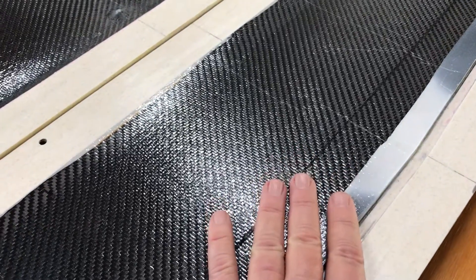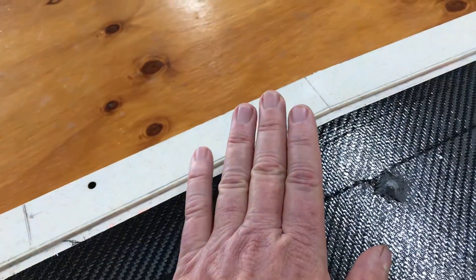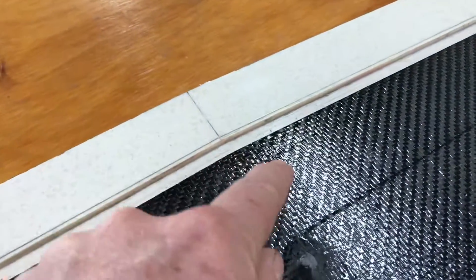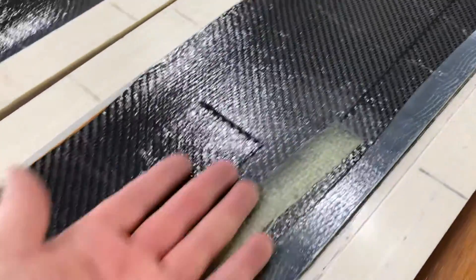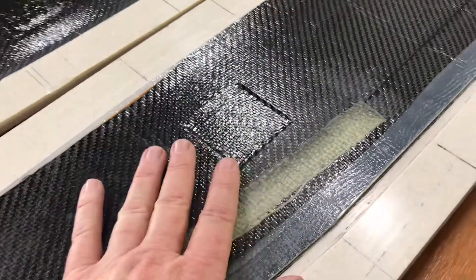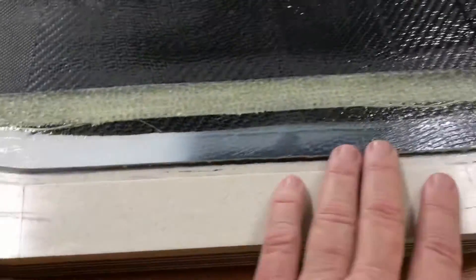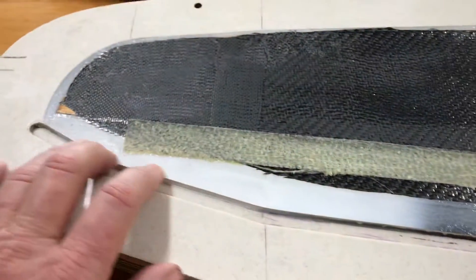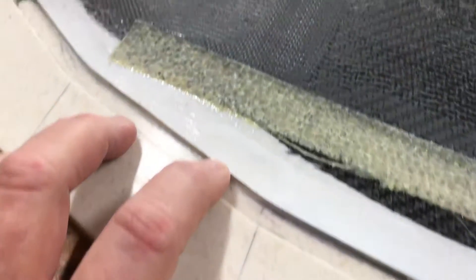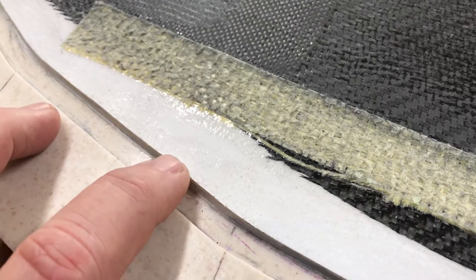That's including the veil cloth. I've left a veil cloth here — you can see the glass stops there, there's a heavier glass that stops there, and the veil cloth and carbon there. No problem — except the perforated plastic breather film, first time ever, stuck to the laminate. Consequently, trying to remove the perforated plastic from this area of veil cloth — there's no material there to keep it rigid — it actually lifted the skin off the mold.